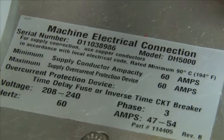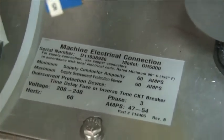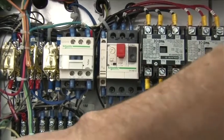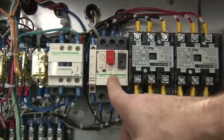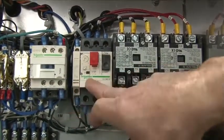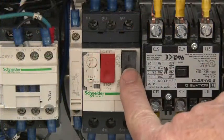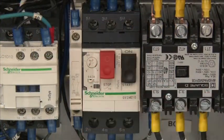Here's the machine's electrical connection. This gives you the min-max average for the breaker size. On new installations, when bringing the main power to the power block, also check the overload setting. This is not uncommon on new installations where the machine has been traveling on a truck — it can jar and trip the overload. Reset by pushing the black button that has a star on it.